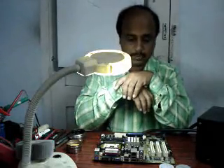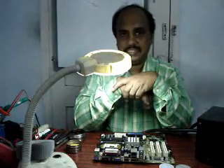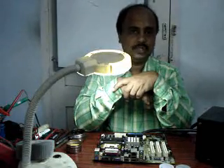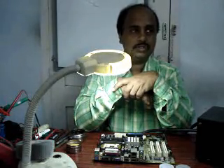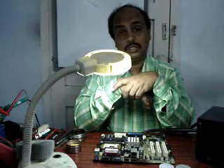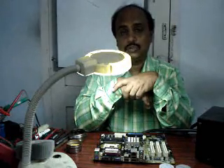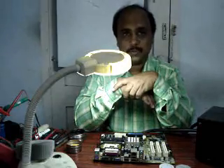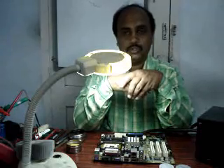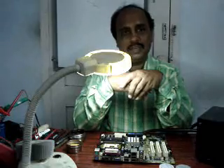So these are the things I will be talking about now. A very important thing is to keep the life of the ICs. Whenever I use a hot air gun, the temperature of the IC rises quite significantly, because removing and pasting requires approximately a temperature of around 180 to 250 degrees centigrade. So we have to bring down the temperature as soon as possible to around 30 to 40 degrees, near about room temperature. To do this, we use isopropyl alcohol.